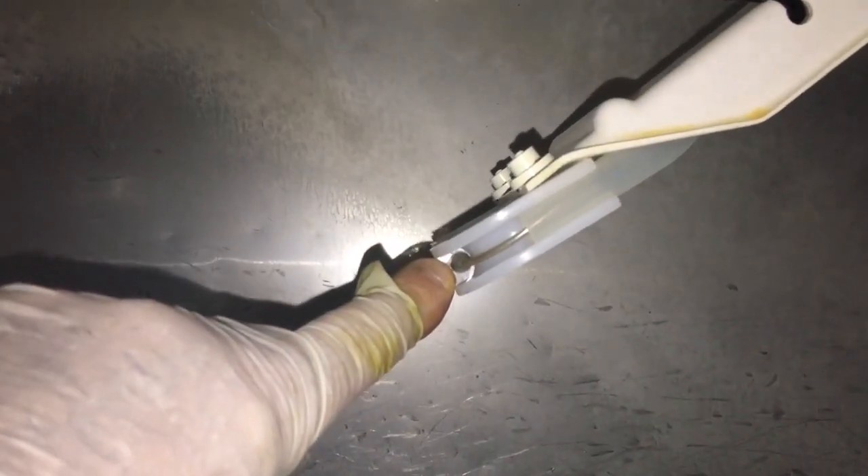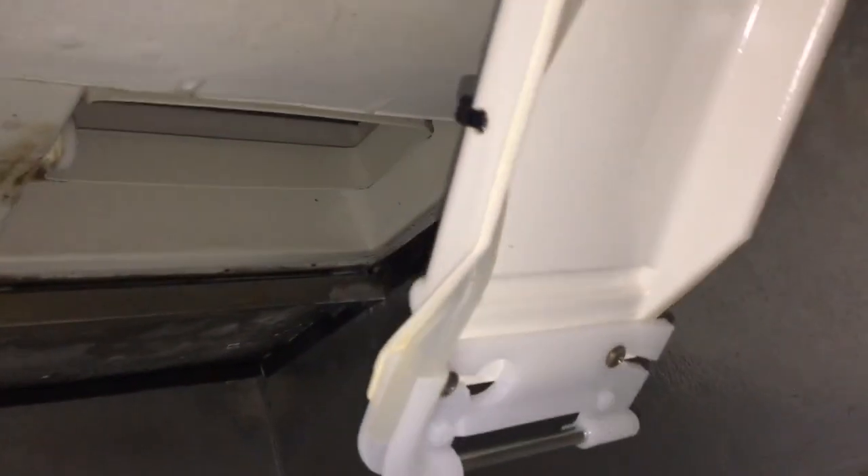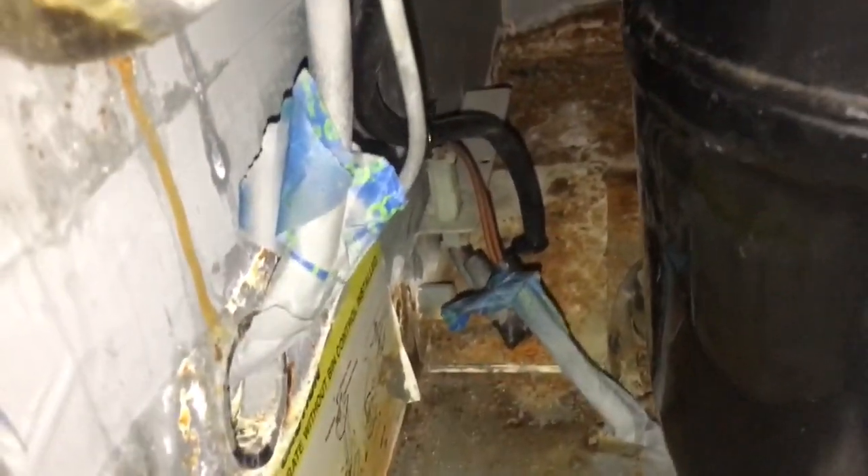I had to drill out this hole to 11/64ths — it wasn't big enough. I secured it like this: put one wire tie, and you run the bin stat through the tube and secure it up like that. That's how you keep them out of danger's way, running the bin stat on the inside. That's the way they're supposed to be done. Then I run them up like that.